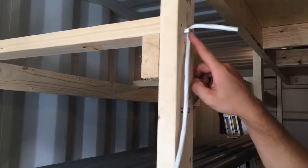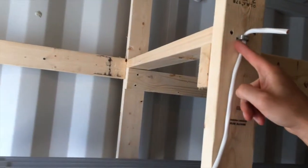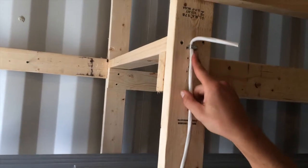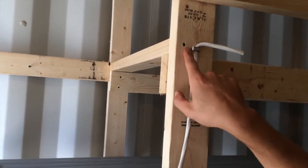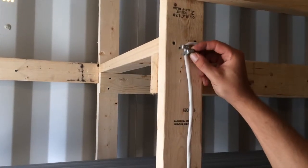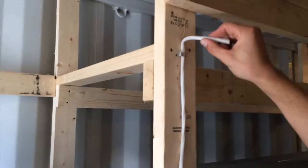On the 2x4 you only have 32mm, or you have to be 32mm away from the side. So basically on a 2x4 you only have almost the center to work with. You'll see that the staples are pushed into the stud a little bit, but you're supposed to stop at these little standoffs here.